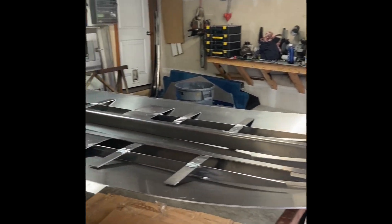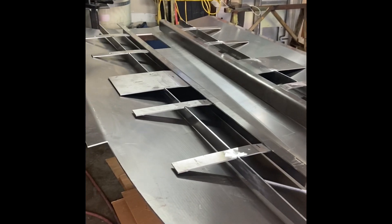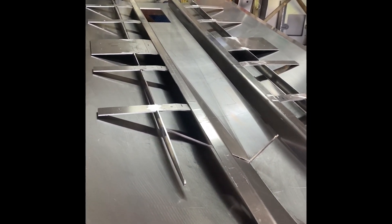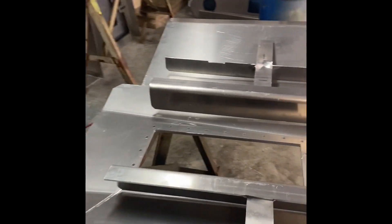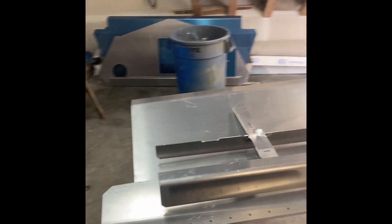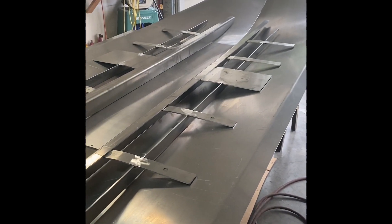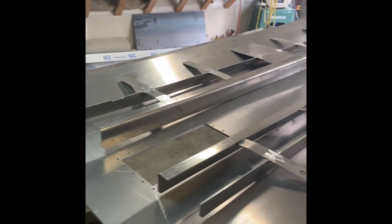Here it is — got the bottom side flipped over. Once we flipped it, I was pretty stoked looking at all the seams from the other side for the first time. They're all really tight — that's going to make the weld-out and the strength all that much better. Here are the two independent deck supports or engine bearers — these are just placed in here and still need to find their location to get tacked and welded in. From what I understand, you put the hydro blaster pump in here as a temporary reference to find the exact location for the transom. Thanks for watching — don't forget to like, subscribe, and enable notifications.